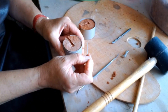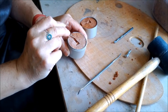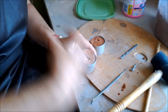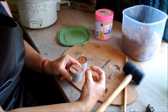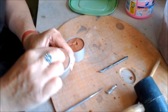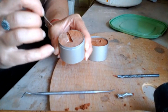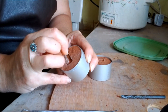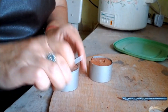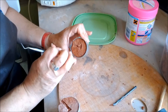Now at this point we've got to put in what's called risers. If I were to just try and pour metal into this void without doing the risers, there would be nothing to draw the molten liquid through the void. So we've got to put holes through the mould, through the void in different places to encourage the air to draw the metal through and go into every little crevice. I'll make a few risers at the side as well.